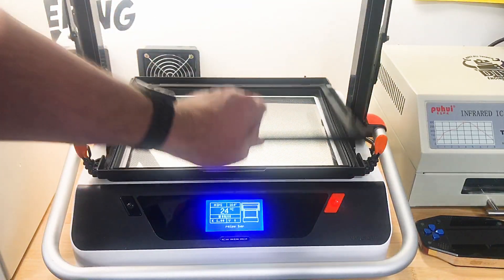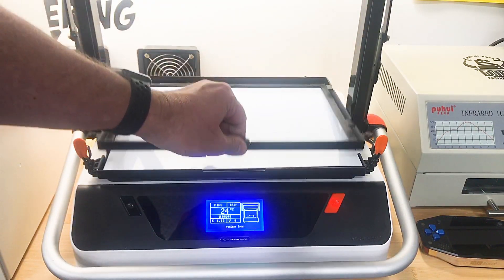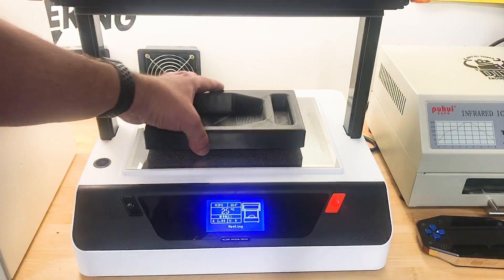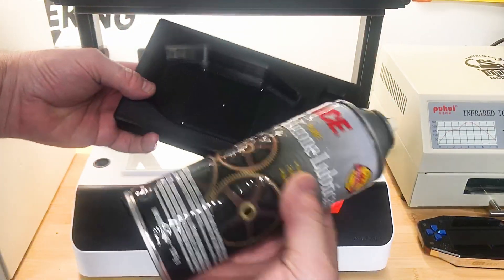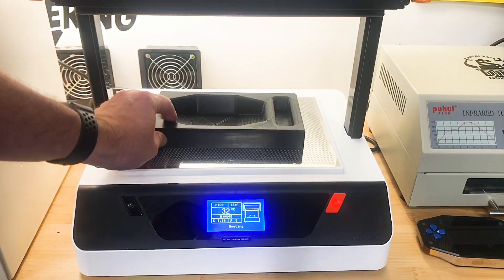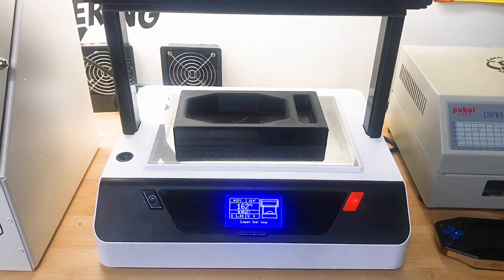The sheet carrier has a two-part frame and it's adjustable for different thicknesses of plastic. You basically insert your material, clamp the frame together, then raise the material up to the heating element where it's magnetically held in place. While it's heating I spray some food grade silicone on my forming buck and place it in the vacuum area. The vacuum area is 9 by 12 inches, which is pretty good in size to work with. The machine monitors the material temperature and when it's just right for the type of material you're using, the internal vacuum turns on to let you know it's showtime.